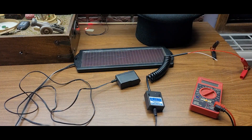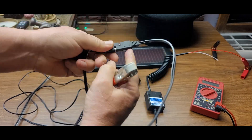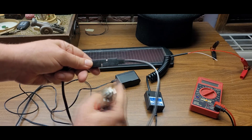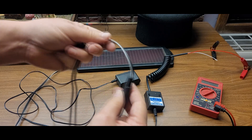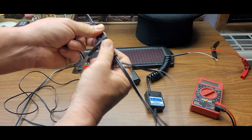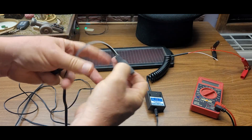The plan is simple. We have the end of the solar panel which would normally connect to the battery — there's a coupler on this one. The slick way would be to get an identical coupler and feed it right into the charge controller, but I'm just going to do a very fast simple modification. When used as a solar panel only we can leave it on; when used with the charge controller we'll just remove the two clamps.